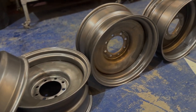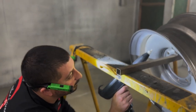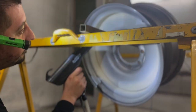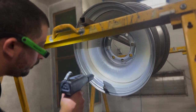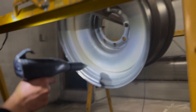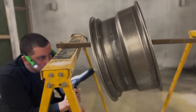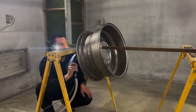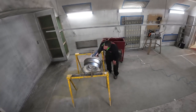This is how we received our wheels from Detroit Steel — just a bare steel wheel. Our powder coater Angel is shooting them with the powder. Powder coat sticks on with static electricity, kind of like lint does to clothes. You have to hook the wheel up to a ground, then spray it with the powder, and the powder ends up sticking to it.